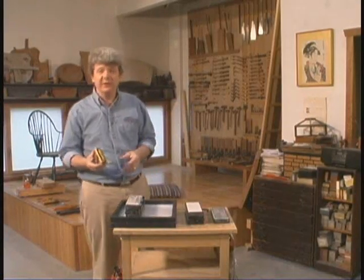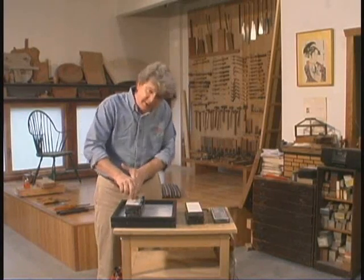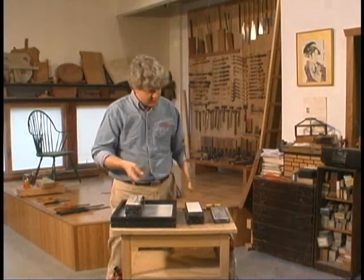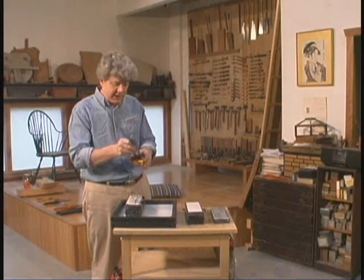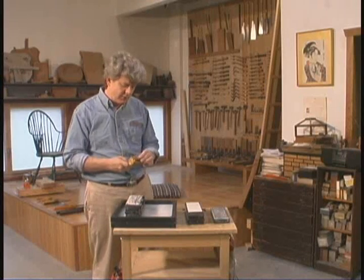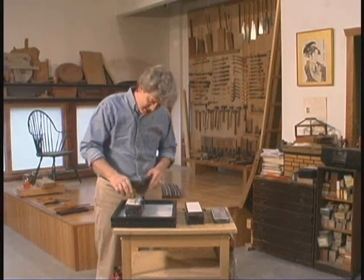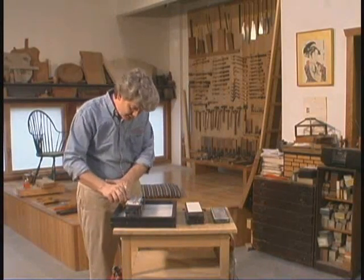I'll tell you, this guide will train you to work freehand. Once you get the idea and it helps you build that motion into your body, then you can just lose the jig altogether and you're sharpening freehand side sharpening again. So this jig will really train you to work accurately and consistently. And if you're going to change your bevel, you can change it using the jig real quickly. You can use it either way — a combination of freehand and jig sharpening — or you can do it all with the jig from start to finish and be totally confident that your edge is exactly at the angle you want it at.